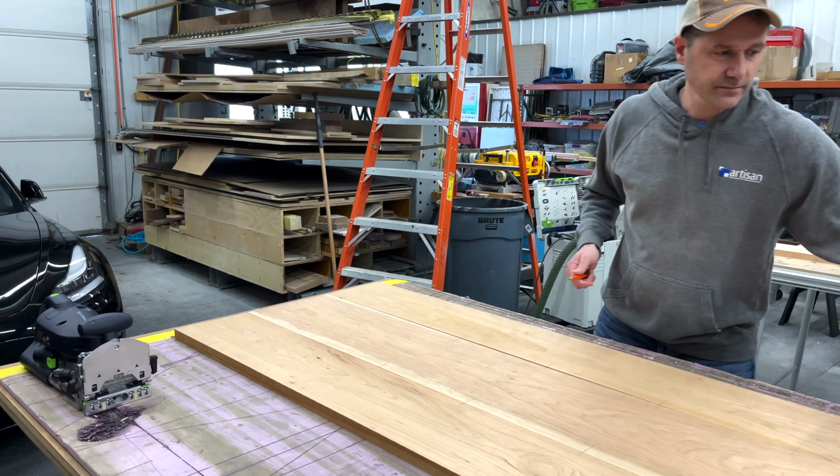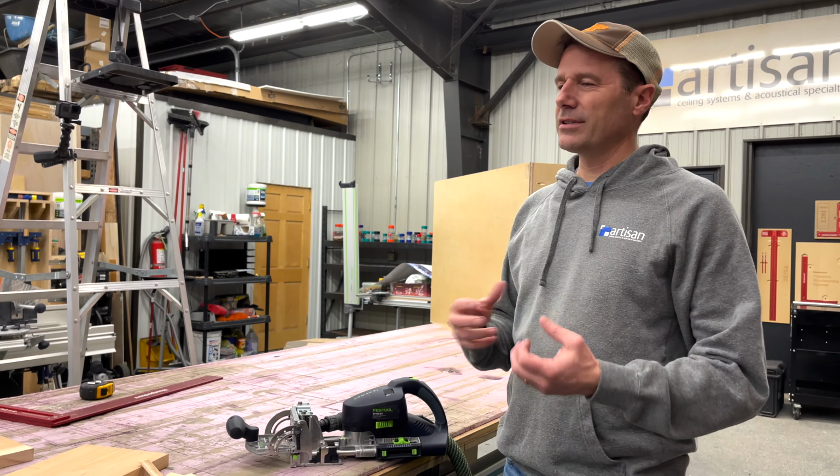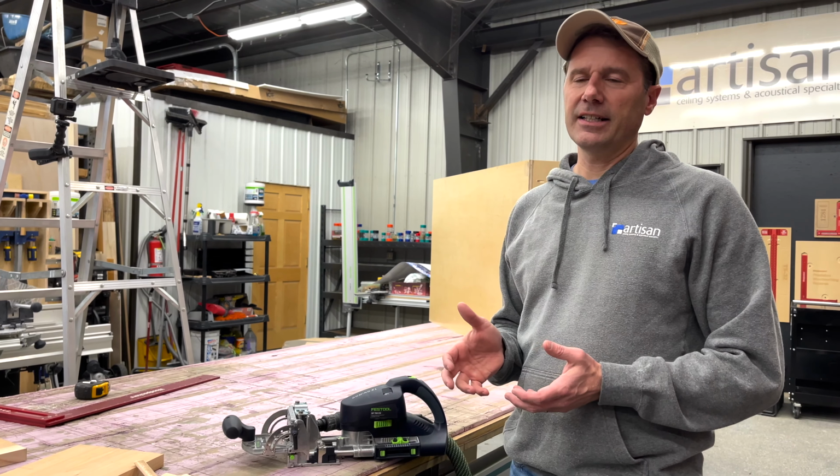All right, like I said, we've got an 8mm by 100mm Domino. To set the plunge depth on this, it will plunge all the way to 70, because the largest Domino they have is 140, and so you're plunging half of that depth. I have 100s, so we really only need to plunge 50. Sometimes I'll plunge 50 on one side and add 5mm, maybe do 55 on the other, just so I know if I put a little too much glue in or something like that, we're okay.